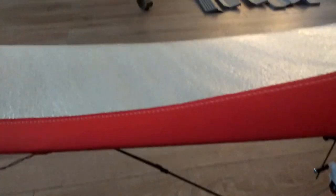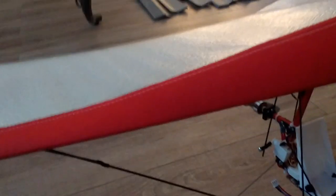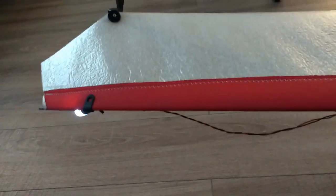These are 12-volt LEDs hooked up to a servo amplifier circuit. It's just an old servo where the motor went bad, so I took out the amplifier circuit and connected the LEDs directly to the output where the motor would go. It's using 5 volts, so they're not that intense — just bright enough that I can see the model and the wingtips so I don't crash into trees.